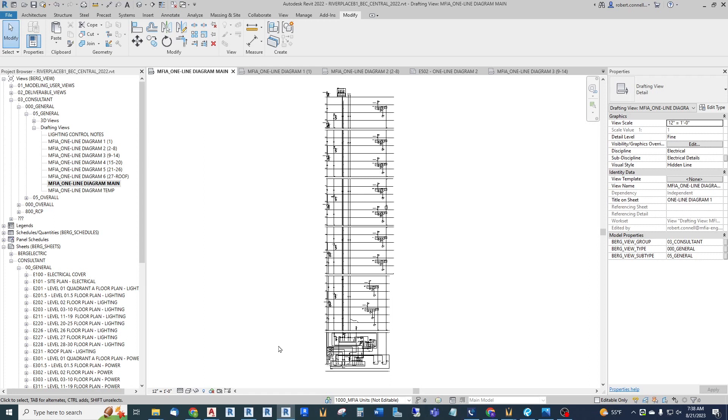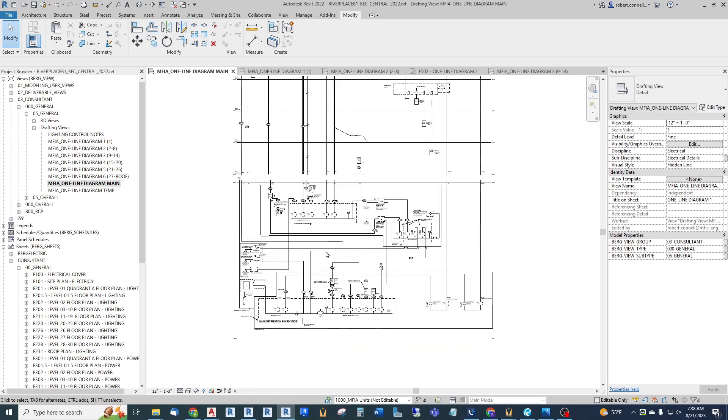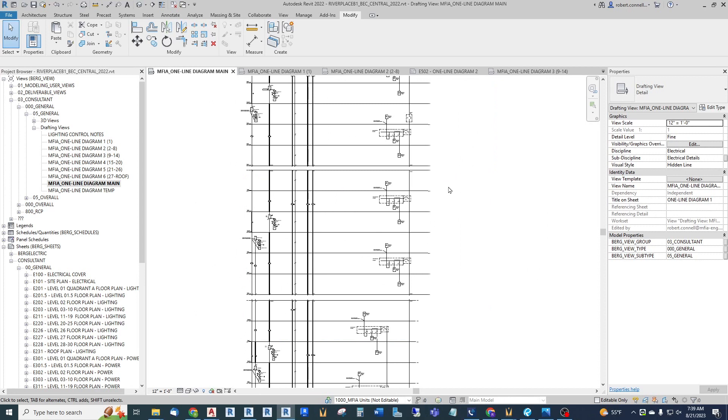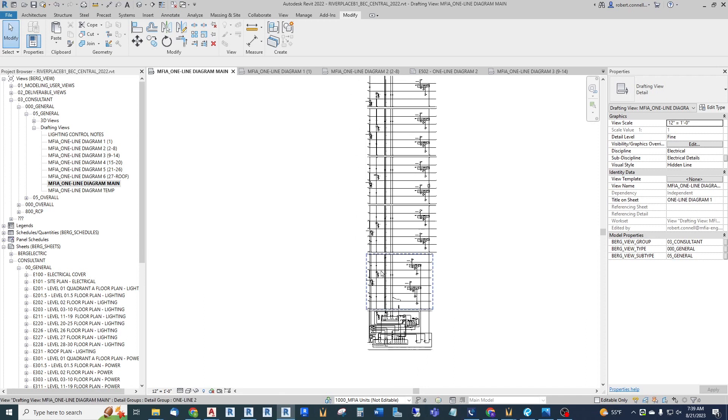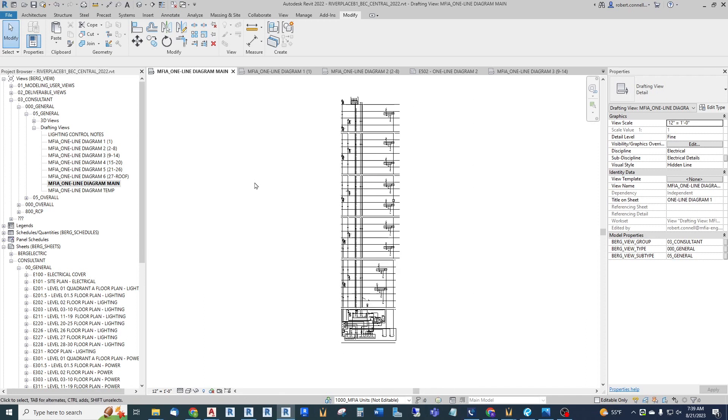What I have here is a project I'm working on - it's a pretty tall residential multi-family 30-story tower, and so the one-line diagram is pretty tall. What I've done is I've drawn it leaving some gaps for different sheets so that each of these sectors will fit on different sheets. The architects do this all the time when they have a large building.